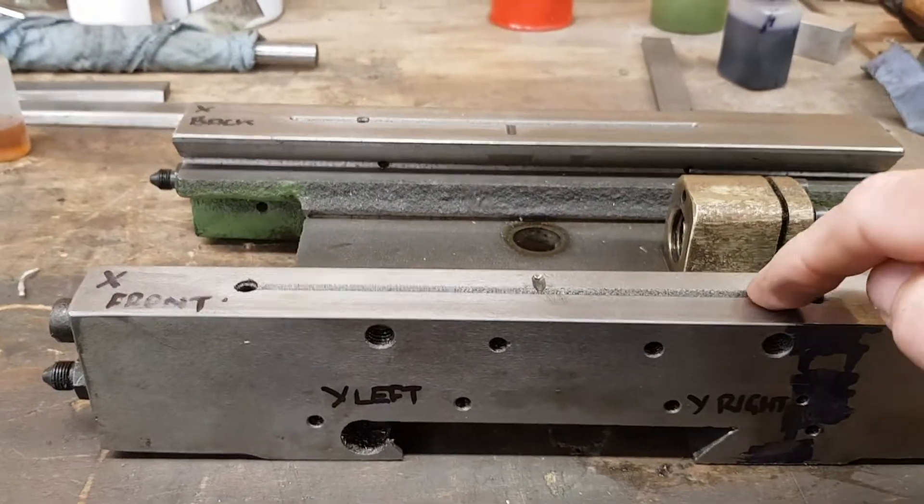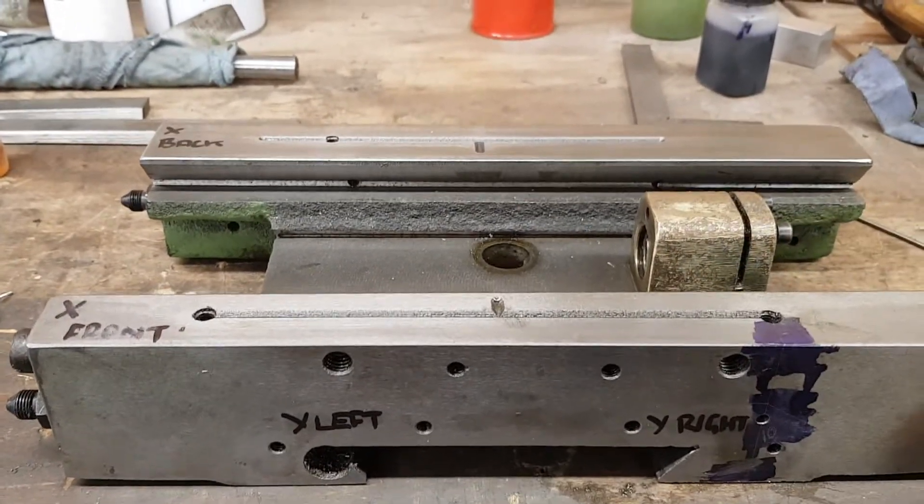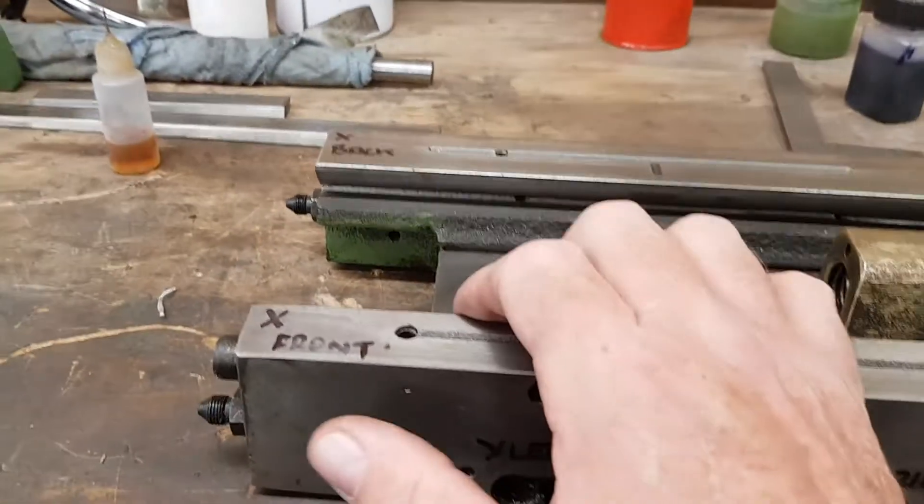This is not ideal because this gallery is not going to maintain oil or stay full. It's going to leak straight down onto the lower way.